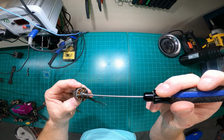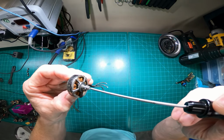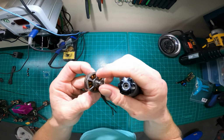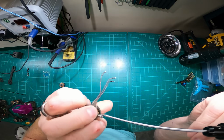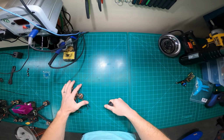These particular motors have kind of a nuance. These get stuck, so that pin will get stuck down. You can lube these, put oil on them, they work great. The other thing I do is plastic will get in the bearing there, and what I'll do is press it in and just work each ball bearing till they're loose, and that usually fixes it. So those are motors.